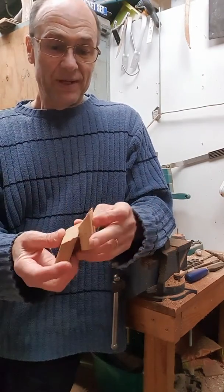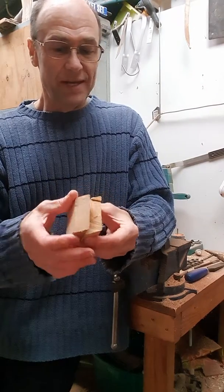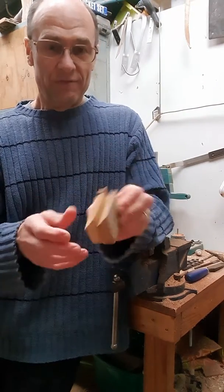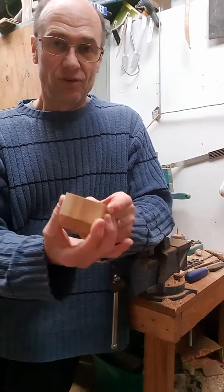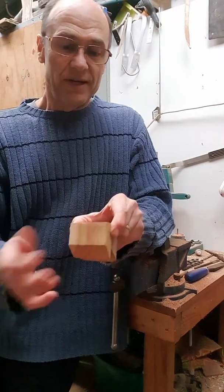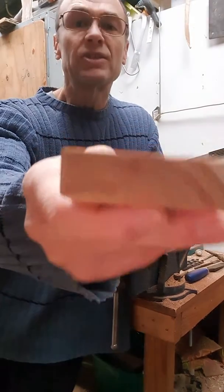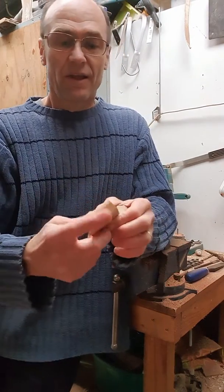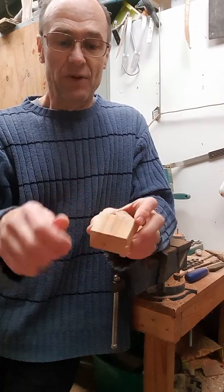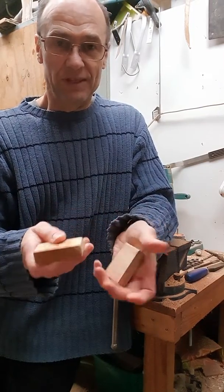And the cypress, well, you can shape it beautifully, really easy, but tricky to use. When I've used the offcuts from some of these, if you try to use them as just straight screw-ins, 9 times out of 10 you'll end up breaking them. If you do decide to use it, make sure you get pieces so you can screw across the grain. If it ends up looking so you're going with the grain, you'll just end up with it splitting straight away. At least you got a bit more of a chance with these.